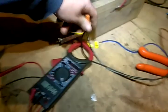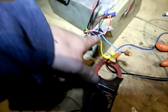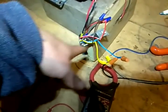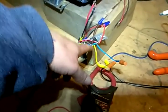The circuit is very simple. I've got a power cord here. I've got my voltage meter set to amps up to 200, on my mains going in for my input. This little circuit I made — I ran it in parallel. I've got two bridge rectifiers, full-wave bridge rectifiers right here, and I wired them both in parallel. The positive of this one's hooked up to the positive of this one, the negative of this one's hooked up to the negative of this one, and it goes out to the motor on both positive and negative.